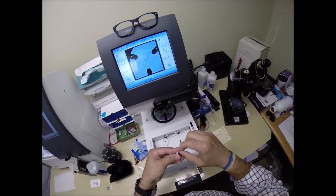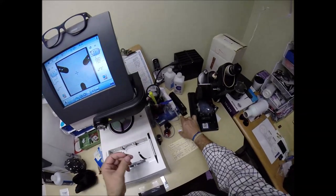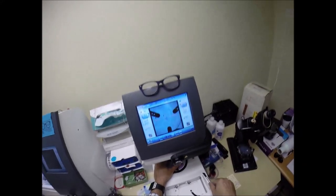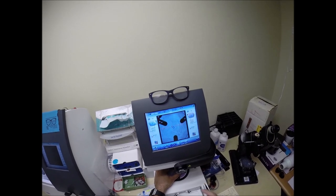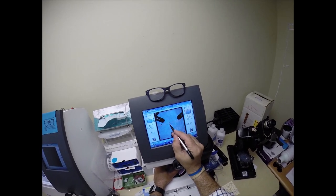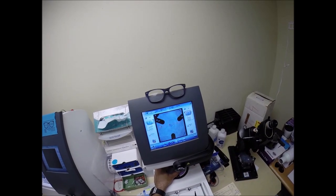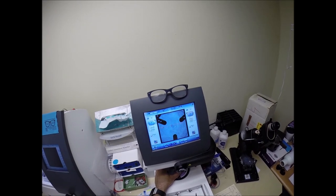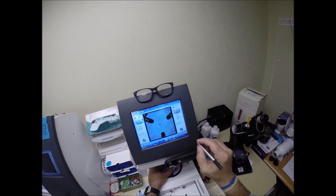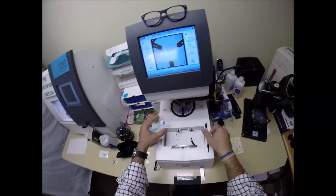Let's do the same thing now for the left lens. Line up the magnet. Grab the L — which is Latin for not right, I think. Normally that would go dead center in that bar, and these other two dots tell me it's lined up perfectly. I'm going to move that over a quarter of a millimeter, giving me a total of half a millimeter for both lenses. Hit that button — the arm is going to come down and place the block onto the left lens.